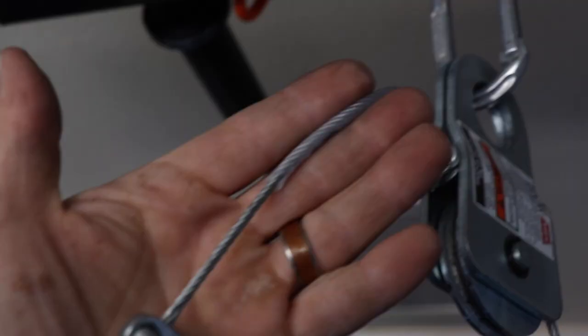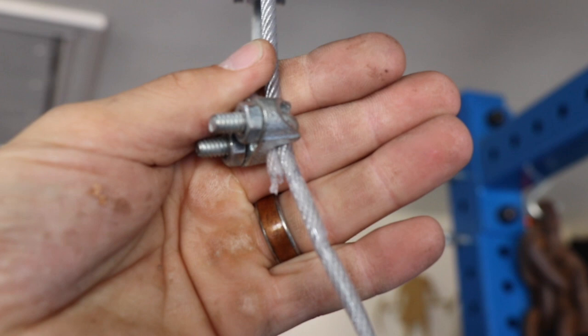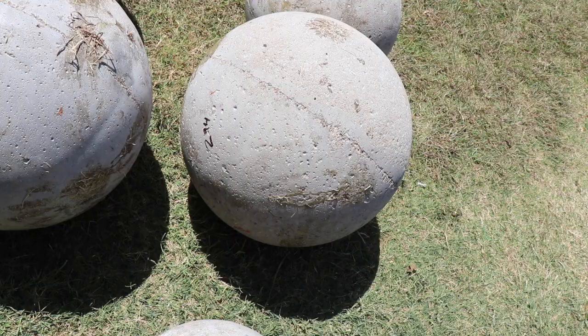Like everything, there seems to be a limiting factor, and when you're weighing giant Atlas stones using a nylon braided cable, this is your limiting factor. You can actually see it pulling the nylon off — you can see the extra bit of nylon fraying there. I ended up just tightening it down some more and wondering if going straight to the steel would still hold. Going straight to the steel, it definitely held really well.